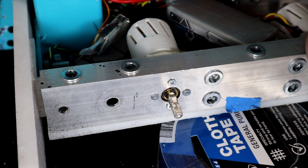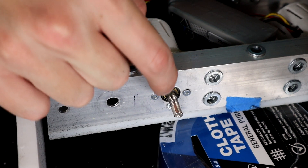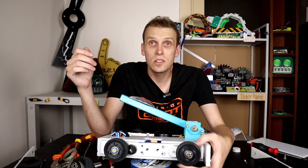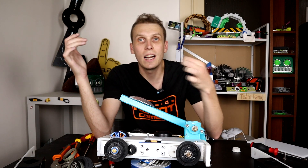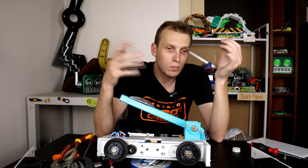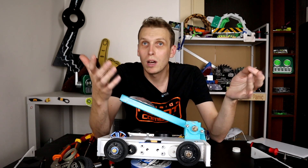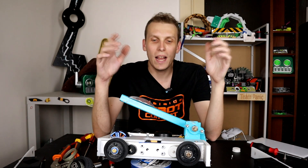The motor shaft down here is pretty bad as well — it is beaten and chewed up. I think it's mostly chewed up from the Scotch key that I did at the actual event with the screws, because there are definitely screw ridges ground into this shaft now. It's amazing how much output power this thing has. I've decided against taking the other side apart since it does still work. However, we know that this system doesn't work — we destroyed one bolt already and it is going to just keep chewing bolts until it breaks everything. We need a better system. We need to machine hubs or laser cut hubs or something. This was just a quickie test to see if we could get something working with the equipment I had on hand, and the answer is no — which is unfortunate, but sometimes that is the way this type of thing goes.